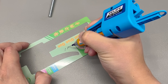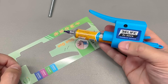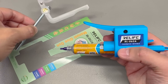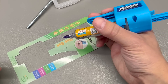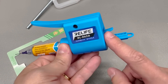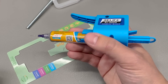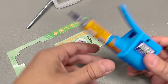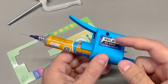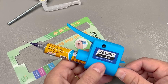Let me install this on the syringe and see how it behaves — it even has needle holders on the side which is very nice. This one feels nicer. It doesn't necessarily offer a higher lever effect so it applies about the same force as the old device, but it feels a lot more solid when you press the lever, and there's a latching mechanism which keeps the plunger pressed on the syringe. It's heavier and more expensive, but for viscous stuff like solder paste you want the more reliable option. For flux syringes I don't even need a booster since flux oozes out easily.